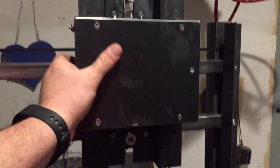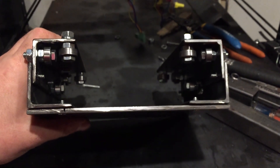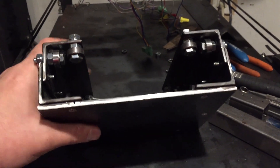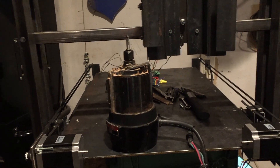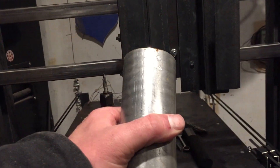The z-axis carriages are pretty much exactly like the y-axis - we have a carriage on each side and attach the two of them with the closeout panel. I kept everything nice and tight trying to hold our tolerance, which seems to be working out pretty well. Now I've got to find a home for this gargantuan router - it's about 12 inches in circumference and the biggest pipe I have is about six inches.